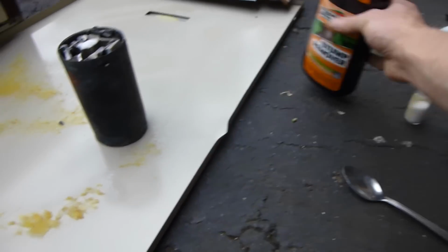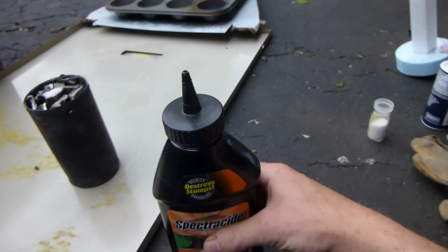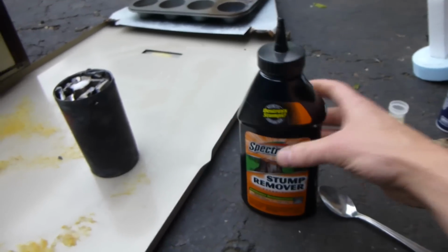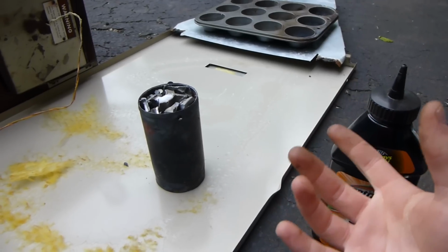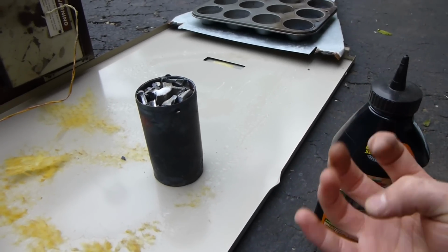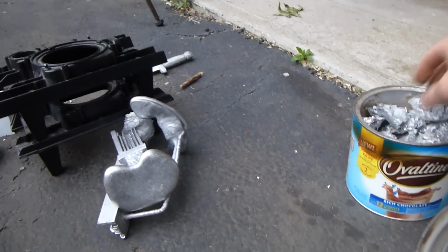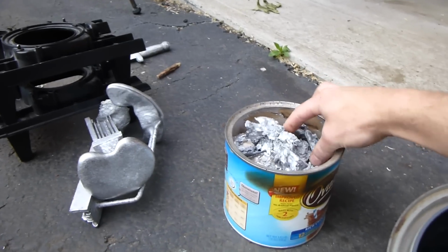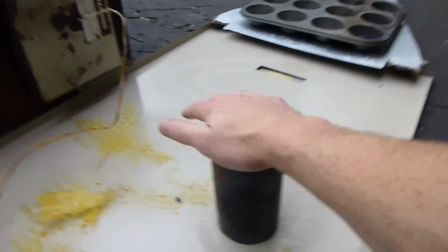And then the other thing I read is that if you add potassium nitrate, it's an exothermic reaction when you add it, so it heats the metal up more, and I guess also makes the metal more liquidy, so it draws all the aluminum out of the dross. So hopefully I might be able to get some of this aluminum out of here, and it turns the dross into more of a powder, apparently. So we'll see how that works. I'm not sure yet. We'll find out, I guess.